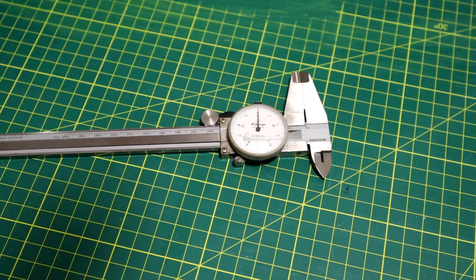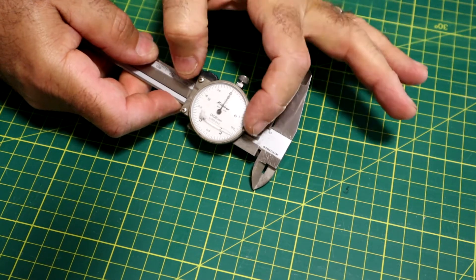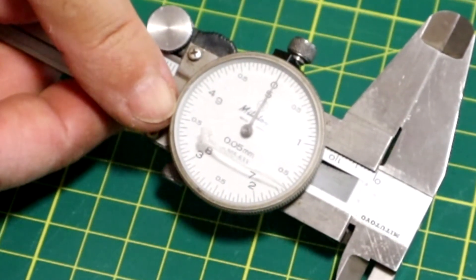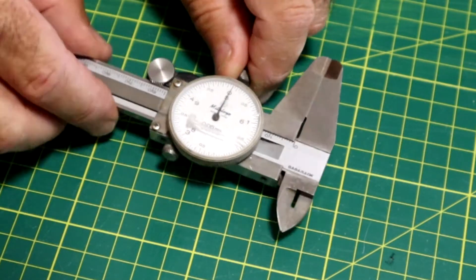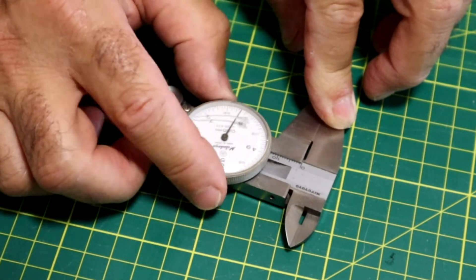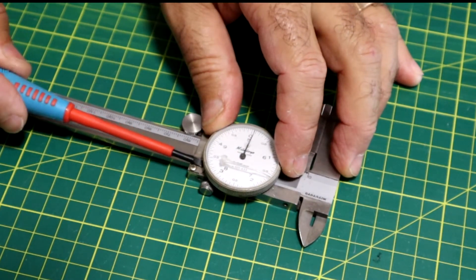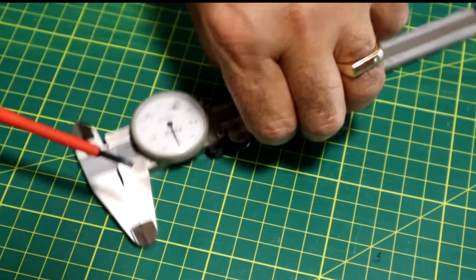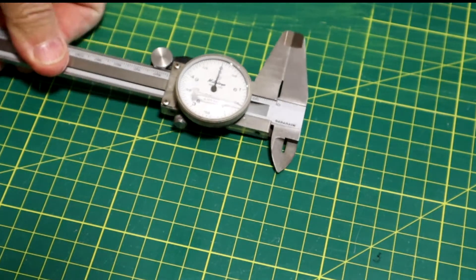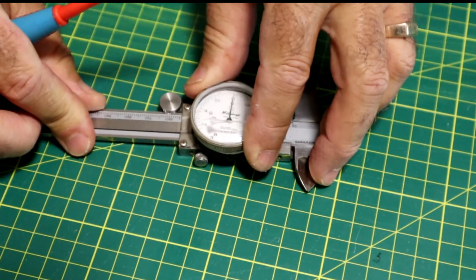The first thing I'm going to do is take the bezel locking mechanism off, because this bezel here needs to lift off. You can see the crack in the lens — it's also referred to as a crystal. This part rotates so you can zero or set a different measurement. I'm just going to use a jeweler's screwdriver under the bezel and lift it off, taking it off evenly.